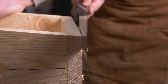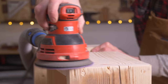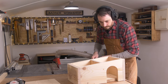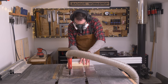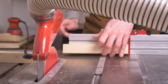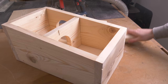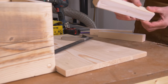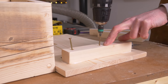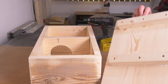While I wait for that glue to dry I can come back and trim off these plugs, then just give it all a good sand down. I've thought about several ways of attaching the roof because I want it to be removable. I've thought about hinging it, but what I'm going to do is cut down some internal dividers that fit perfectly and then attach them to the roof — they're going to lock it in place but also keep it flat. These just get installed with some glue and screws and then the roof or lid just lifts on and off.